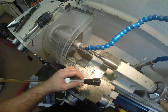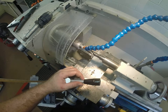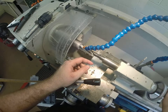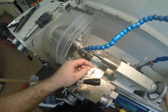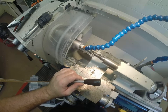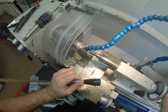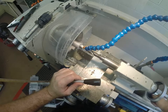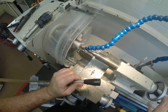You are removing quite a bit of waste material from the inside of this, so you do need to just keep going slowly. I'm nearly through but I don't want to rush because I don't want to overload the drill bit, heat it up, make it blunt. It's through, so I can bring it out.